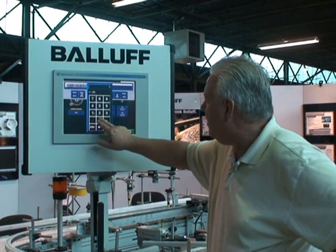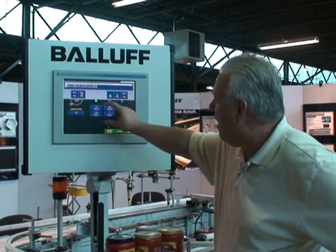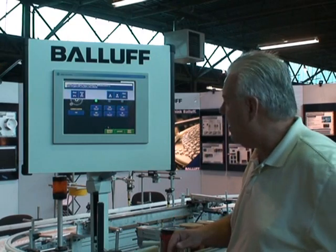If I want to put it at 10 degrees for the start of the cam, or change the end value to 190 degrees — after setting that, this cam is firing. You'd use this to make machine functions fire solenoid valves, run diverters, or things of that sort.